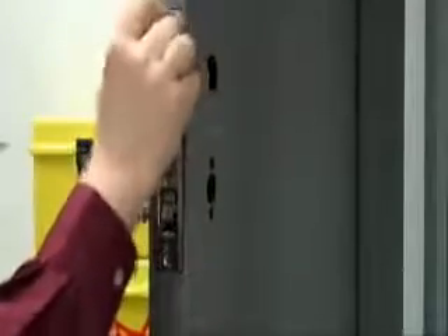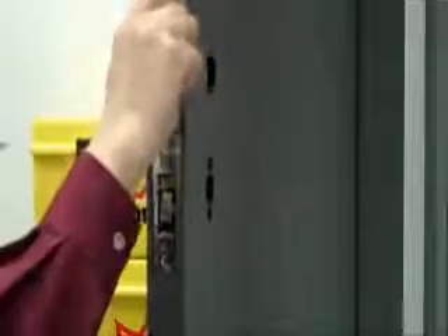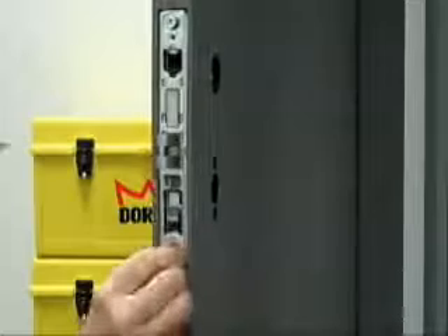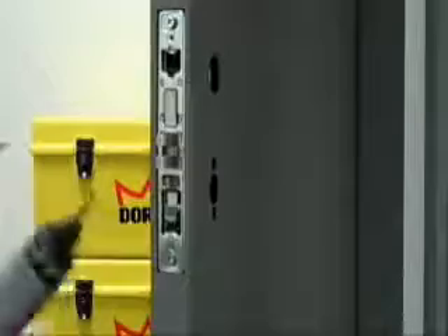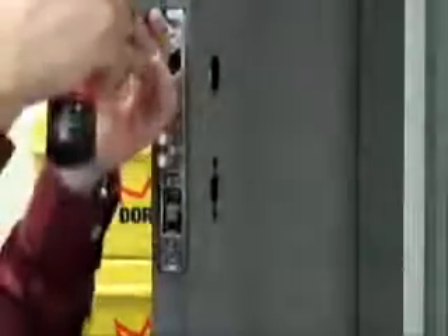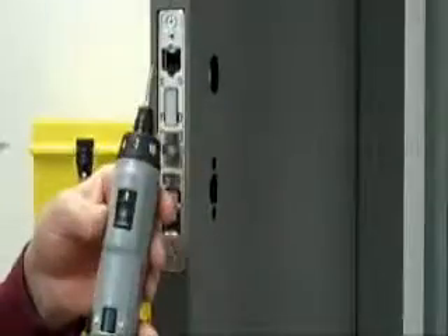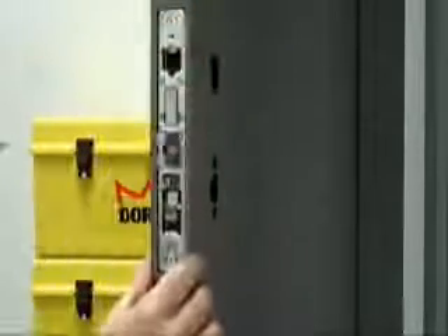There's going to be one screw on the top and one screw on the bottom. In this particular video, to keep it as brief as possible, I'm going to use my battery-powered screwdriver. That is a nice to have, not a need to have — you can certainly put these in with a standard hand screwdriver. Whenever working with these, do realize that they have an adjustable clutch and we want to turn that back so that we don't over-tighten and strip the screws. Now that I've had the opportunity to install the chassis, I can get ready to put the outside trim onto the door.